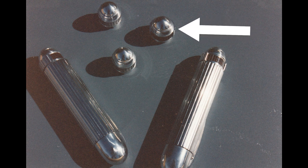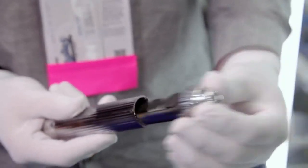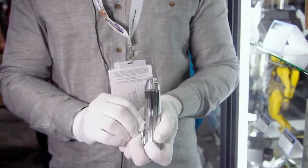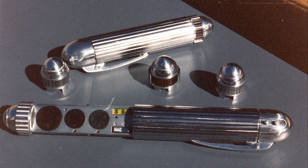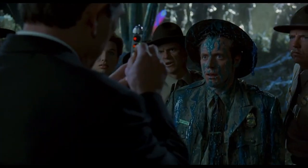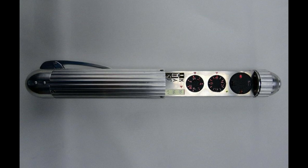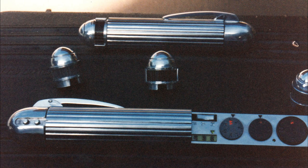The top piece we molded and cast in urethane, then sent to a foundry to be cast out of metal. The neuralyzer was spring-loaded, and this little clip was the button to open it. If you pressed it here, it would release it here, and the inner core would shoot out. This core had all of the working controls. The dials were acid etched out of brass and had LED lights behind them to illuminate the date. It was really difficult to package all of these electronics, have it spring-loaded, and still be durable. These were tricky little props, and I think we had to make six of them.